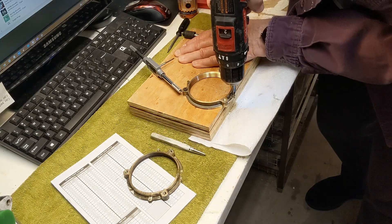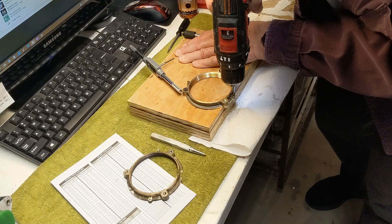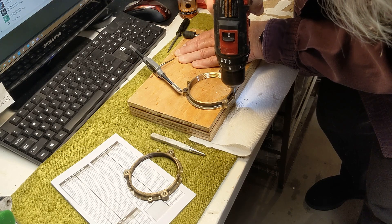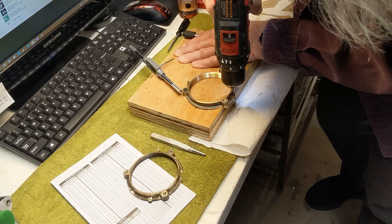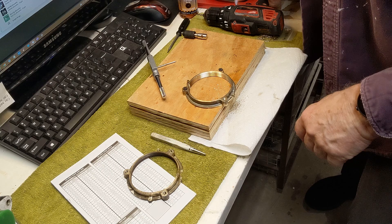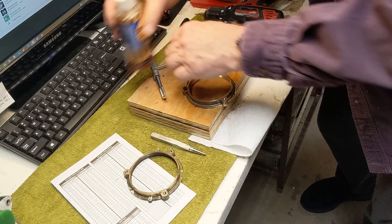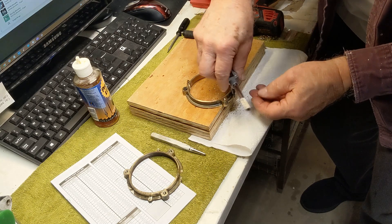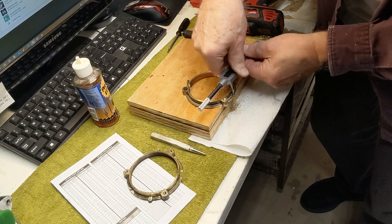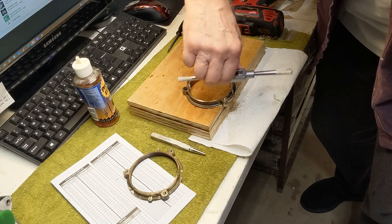This time I'm not going to dilly-dally so much. Hope you can see this — I'm not in the way. There we go — and this one's actually drilled better even though I started at a worse point. Let's put the cutting oil in first, and then my tap. Like I said, the tap will follow the hole, so I just want to hold it straight so it supports itself, so it doesn't break off and doesn't break my flange.